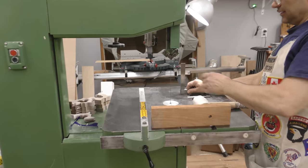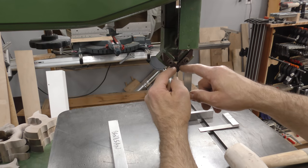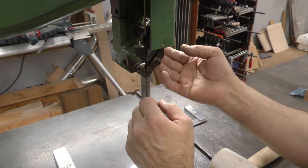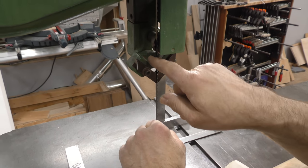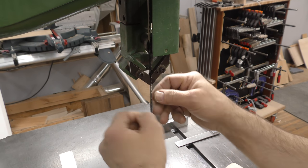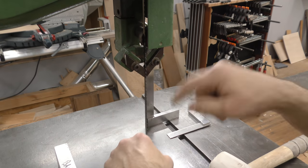Let me show you what we did. The guides weren't perfectly lined up — I've never had this type of angled guide on a bandsaw before. We had to take them off and grind them so the end of the guide matched the slope of the blade, with just a little clearance. We had to move the whole thing back because with a quarter-inch blade it's going to flex. The thrust bearing top and bottom help prevent that. You want your guides just at the base of the gullet — the area between the teeth. If the tooth goes into the guide it'll affect the set of the blade. We moved the apparatus back to expose a little more blade, did the same top and bottom.